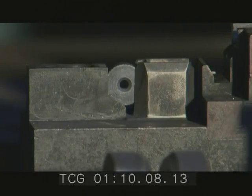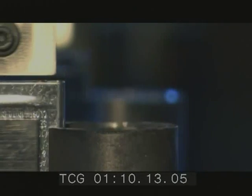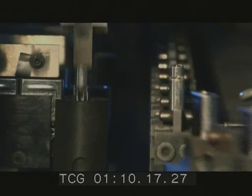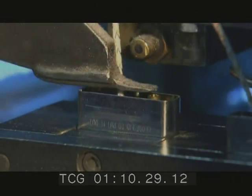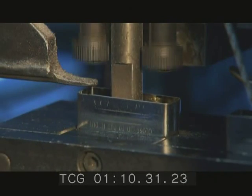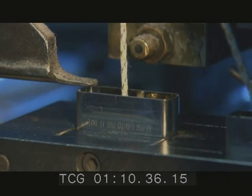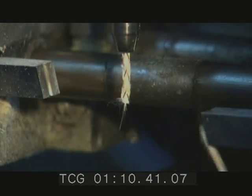The machine grabs an insert and drops it upside down over one of the wheels, so the wheel can be riveted into place. Then the machine adds the wick. It's made from a cotton-like fiber that's laced with copper to make it strong. And it's actually non-flammable at this point. The wick doesn't become flammable until the body of the insert is filled with lighter fluid, which is done after the lighter leaves the factory.